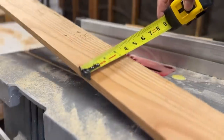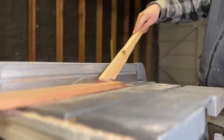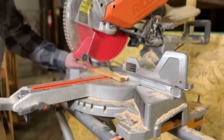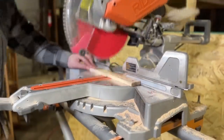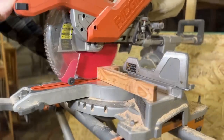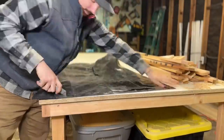The two-by-fours I will turn into the legs, and these will be a glue-up for the top. So let's get to planing. Since I don't want the tabletop to be three inches thick, I'm going to come over to my table saw and rip these slats in half — this will almost double my yield for the glue-up. Next, over to my miter saw to cut off any split or cracked ends. This took a little while — I had to cut and cut some more.